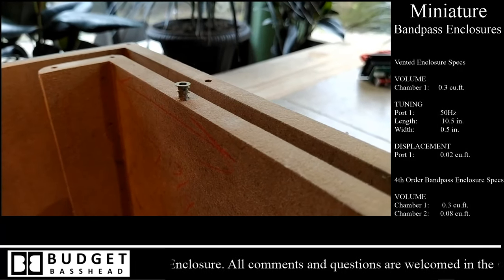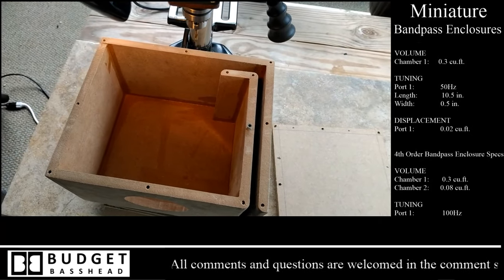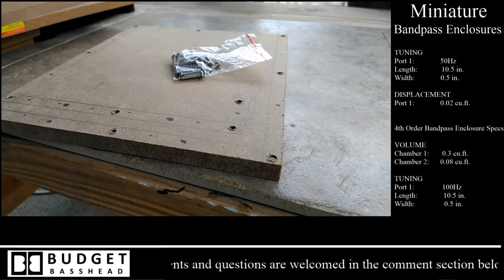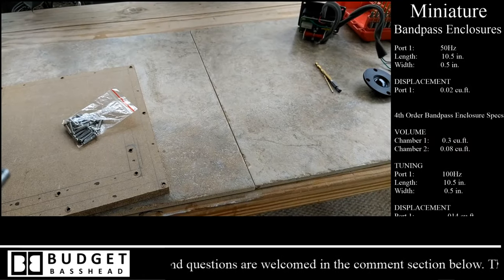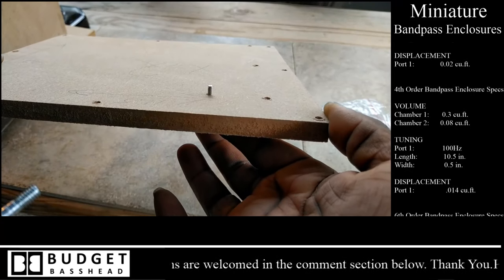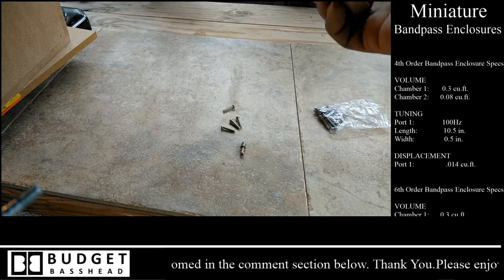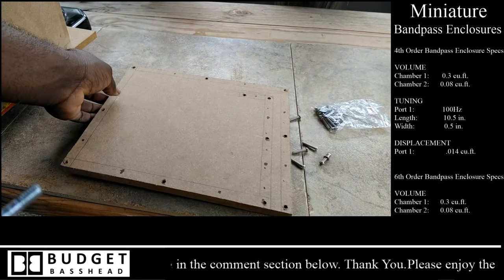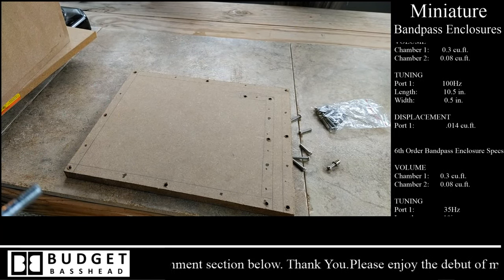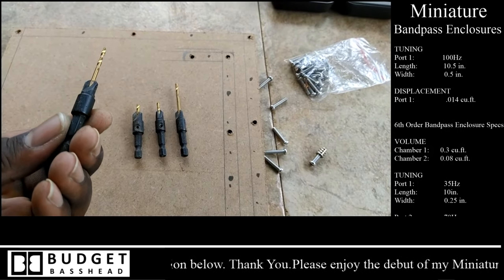Right now, I'm testing the wood insert, and it looks like it fits pretty good. And now what I want to test is the length of these screws right here. The reason why this is important is because I want an airtight seal. So I'm going to be building a gasket, and this doesn't seem like it's sticking out long enough. The gasket itself is 1/4 inch tall, so that thing only looks like it was sticking out about 1/4 inch. So I'm going to have to get some countersinks, and we're going to have to countersink that.